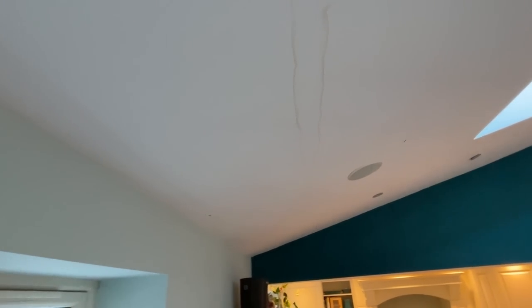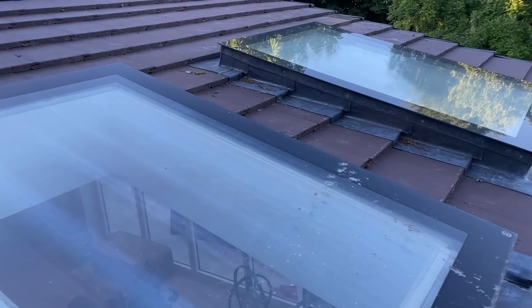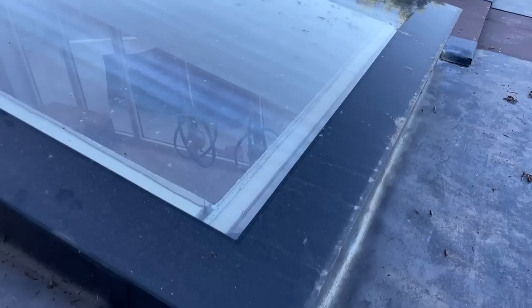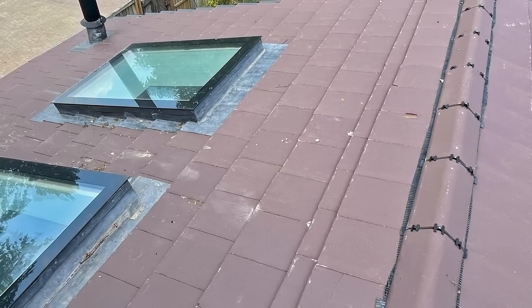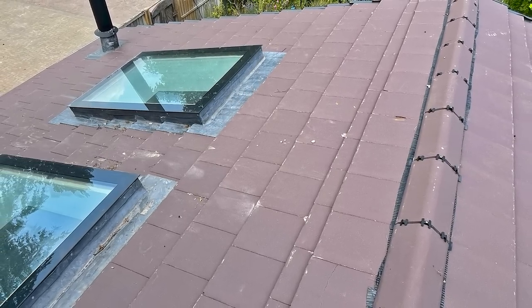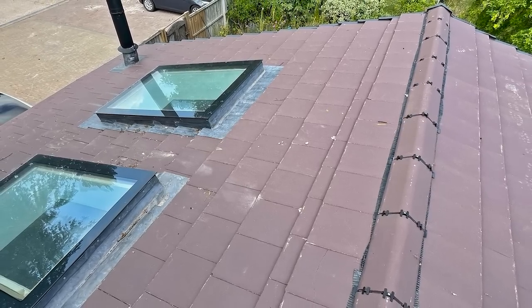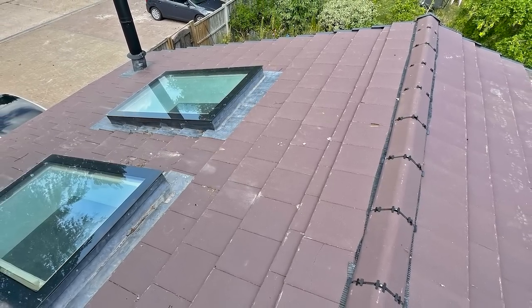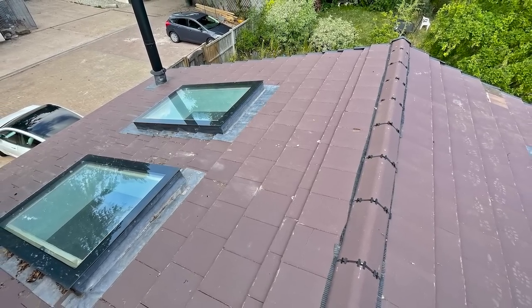The main problem is that the roof leaks — it's only eight months old — but you can see there's crumbly plaster and watermarks around the windows, and also a long horizontal wet patch on one side of the roof. I'm guessing it's water running down inside the ceiling and collecting on a batten. There are also loads of popped screws in the ceiling. Out on the roof there were three or four cracked tiles letting water in onto the roofing membrane underneath.